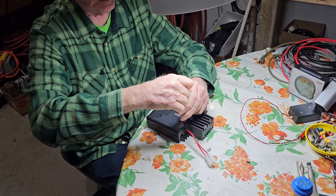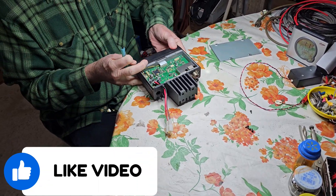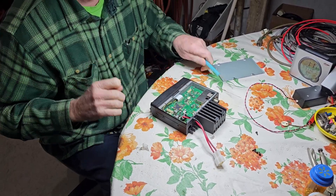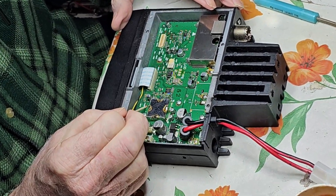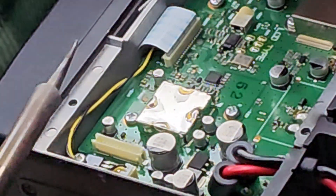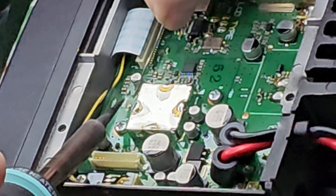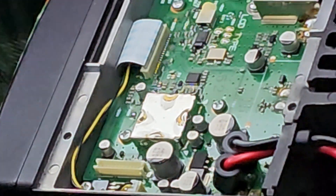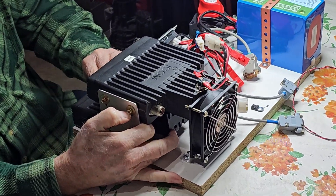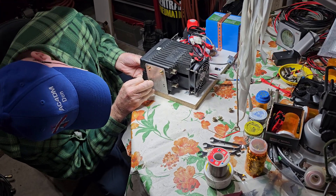The only thing left to do on the cross-band repeater builds is repeater number 7. We were missing a UHF radio and had been scouring the web for an additional UHF. We already have the VHF model 121, but we didn't have any more with the display — the UHF-221s. A subscriber messaged us and let us know he had two of these and wouldn't mind sending them to us. Chris Lanko, K2RIS, sent these two radios to us. You can see Don is putting some solder on the pad so the radio can be used in cross-band repeat mode, and then mounting it into the brackets.